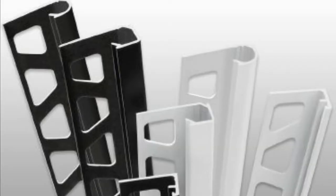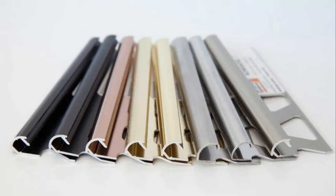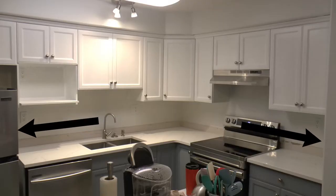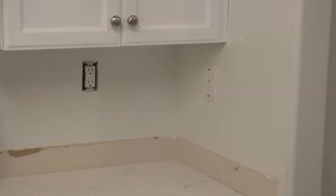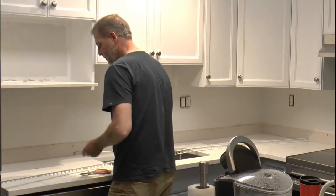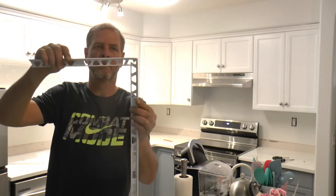Okay, that's enough talk about electrical — let's get back to tiling. I'll be using a plastic Schluter edge profile. Schluter makes a bunch of different edge profiles; they come in different colors, sizes, and materials, much like tile does. When picking the style, you want to make sure that the tile you choose fits the profile — the tile should fit just inside the outer profile edge. I always like to level and square up the exact locations of where the Schluter edge will go. In this kitchen, it will only be on the two open ends of the cabinets. I do this by using a level first off the lower side of the cabinets and then from the edge of the countertop up. With plastic trim, I find it easier to measure across and down, then add those two numbers together to get the length of Schluter needed for each side. Then you can just cut the inside of the plastic at the intersecting measurement points and bend it to create the 90-degree angle you need.